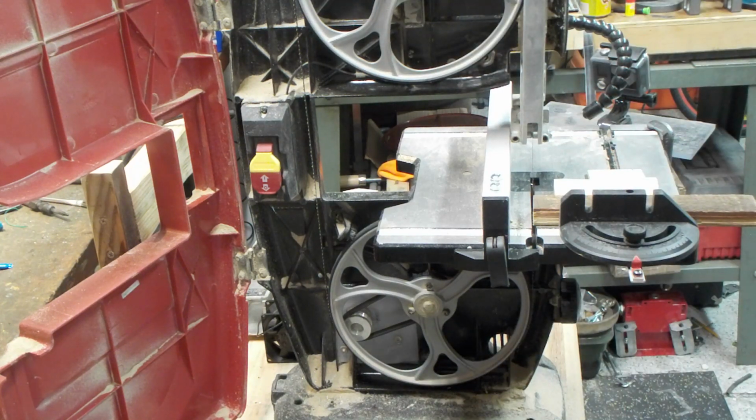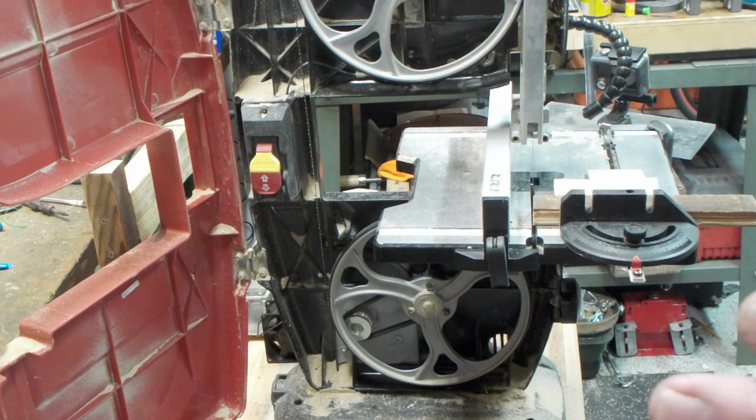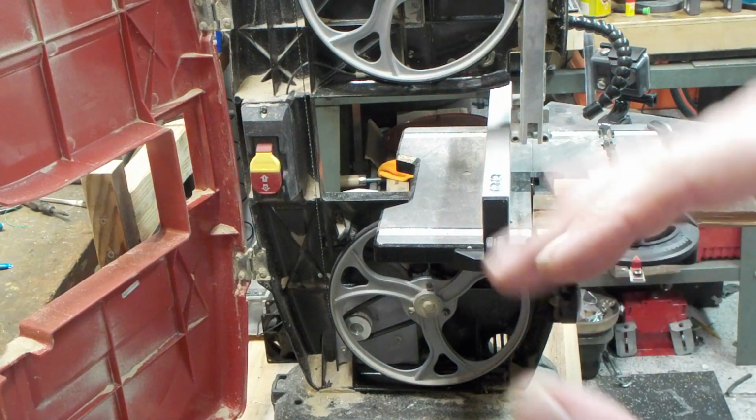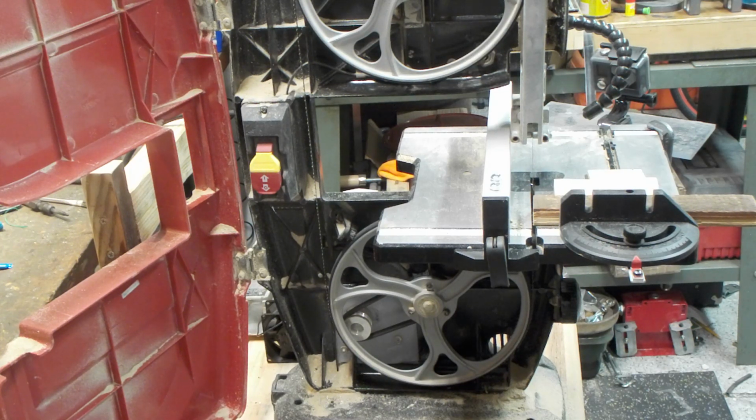So I took some plastic from some milk cartons and made a couple of templates and screwed those up. So I made a couple of templates from those templates and finally got some stuff that fit very well. Basically I got 2 pieces that are sandwiched on either side of a floater piece, if you can imagine that. So at any one time, dust has got to go through 3 layers before it gets to the 4th layer. There is a 4th layer on the motor that runs very, very tight to the motor shaft, and we'll see if that's a good or a bad idea over the long run, but so far it hasn't presented any problems.